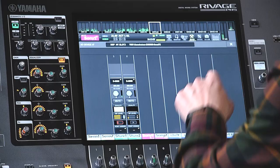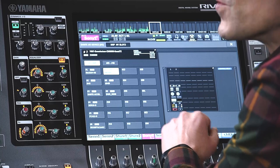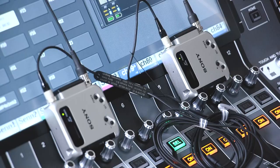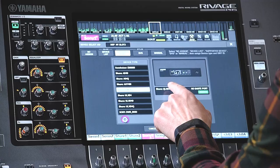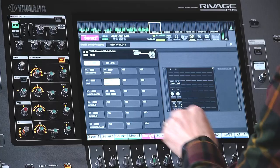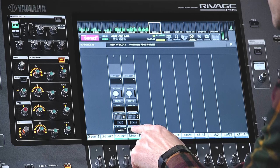Note that some devices such as the Shure AD4Q and Sony DWR-R03D include transmitter gain controls, which have the advantage of adjusting the signal level before it's sent through the air, so you can get better optimization of signal-to-noise. Some Shure devices that don't support Dante, such as QLXD or AXT400, can still be controlled — in that case, use Port Assign in the I/O device window to enable the controls to appear in the channel view, following the input patch.